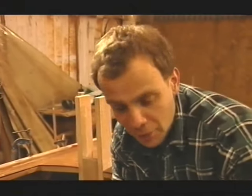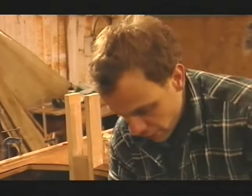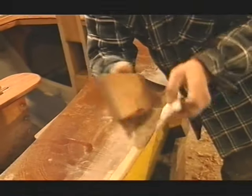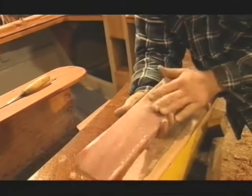It would be quite tempting just to grab your electric sander and walk up and down with your eyes closed, but it'll look so much better if you go on to a nice long straight piece of timber with some paper. You'll get a really much nicer finish. It will take a bit longer, but you won't have to go to the gym tonight. The quality of finish will just go up that one extra little notch, and it'll be well worth your while.